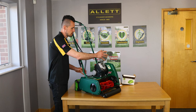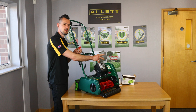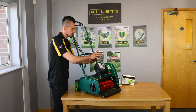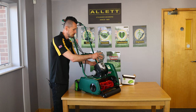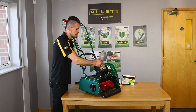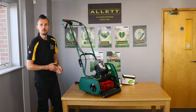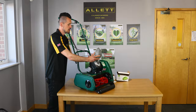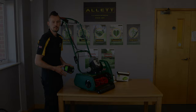To insert the battery into the mower, lift the cover on the power head. You will also notice a red key switch — when removed, this isolates the whole mower from the power source. If the mower is left outside, especially if children are in the area, it does prevent any accidents from happening, so you can remove the battery and also the key switch. To insert the battery, locate the rails into the rails at the top of the power head, slide it in, and push until it clicks to confirm it is fully engaged. To remove, press the grey lever in to disengage the battery from the mower.